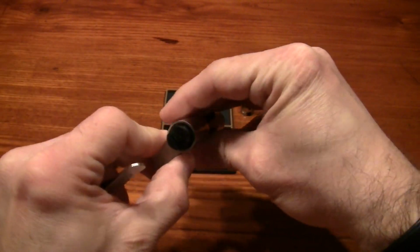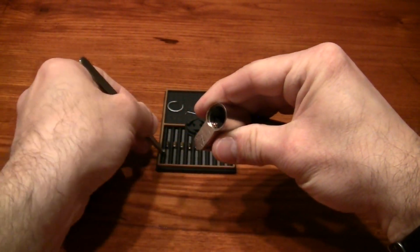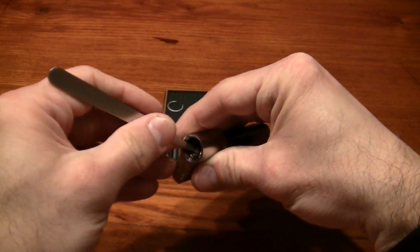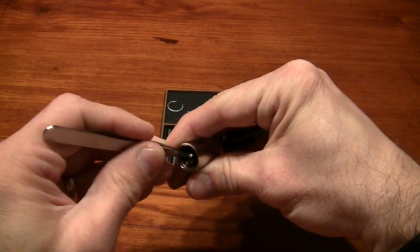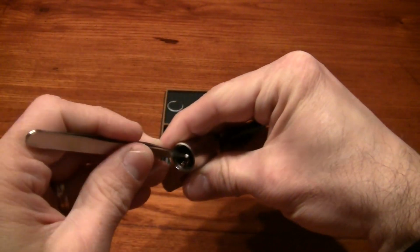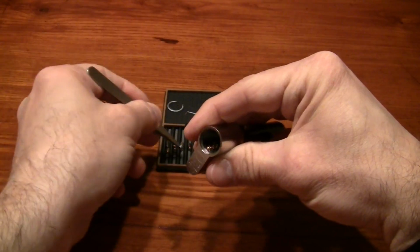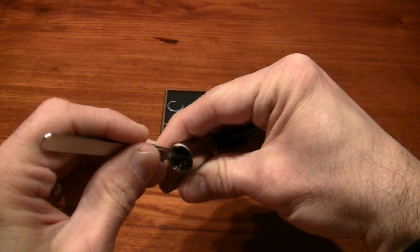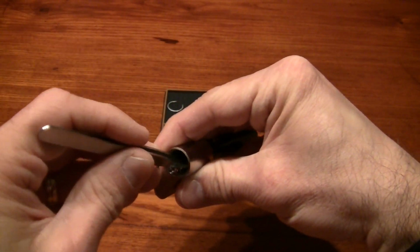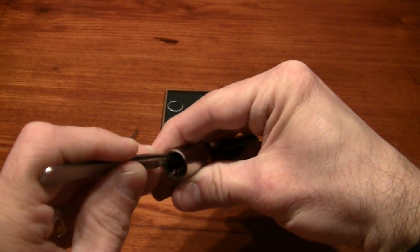Now let's dump the drivers. So number 1 is this T-pin standard. Number 2 is a spool. Now there are the side pin drivers, which are of a similar kind as the dimple pins of the dimple locks from DOM that need curved bottoms because they are offset from the center of the body. So 2 and 3 were spools and the rest are standards.